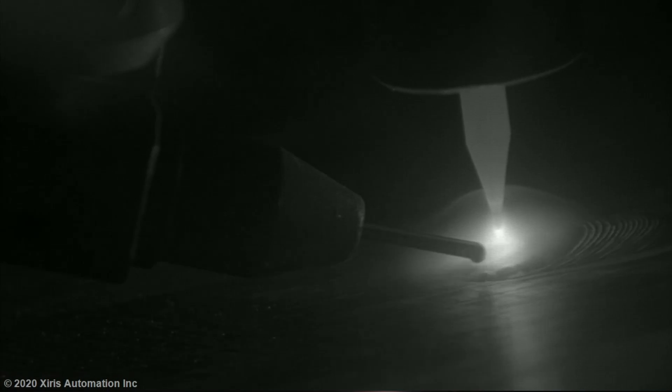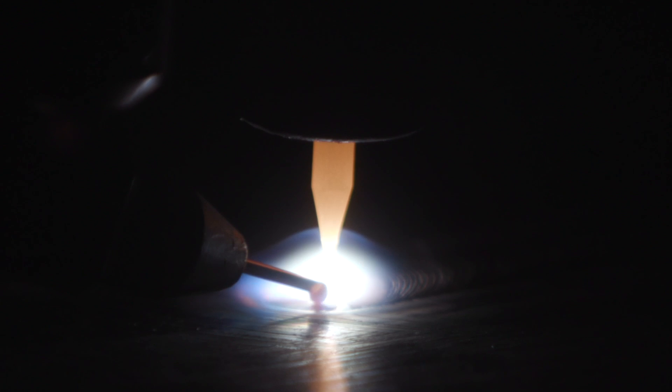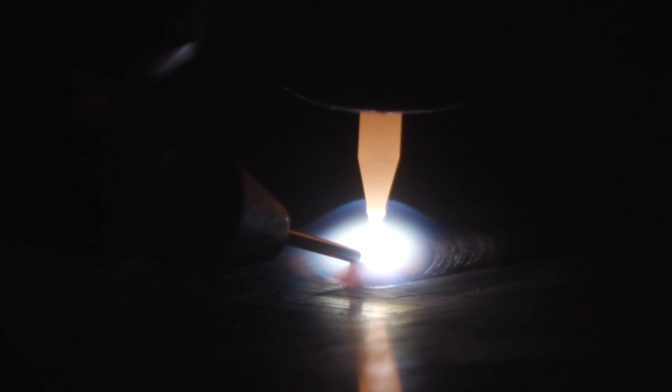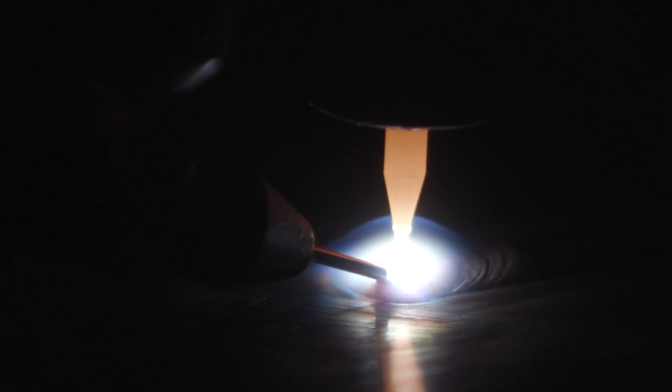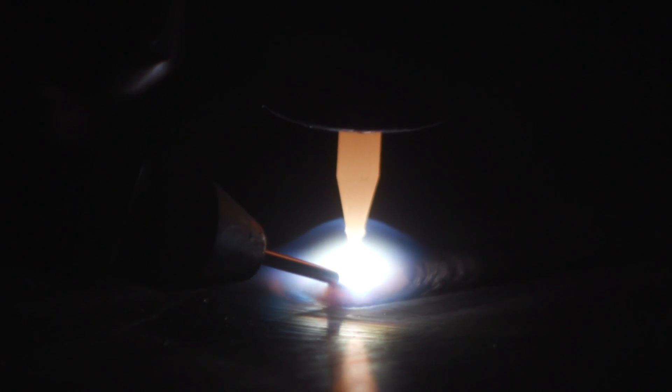I'm adding a little bit more wire - I can see it's balling up a little bit. The cool thing is you can add wire right here on this TIG rig - that's what's nice about it. See how we just cleared it up right there. I'm not going to play with my amps at all. I'm running 175 amps, travel speed 5.2, 3/32 tungsten. Running about 0.52 on the wire speed on the cold wire feeder - continuously feeding the whole time, maintaining about a 3/32 stick out.